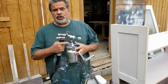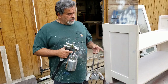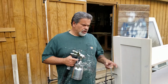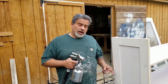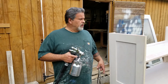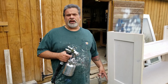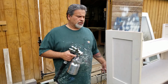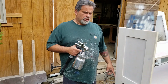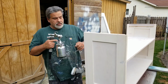And I'm spraying Enduro Clear, because I got a whole gallon of it. And I like it because it dries fast. And when I use it on this whitewash, I usually get away with one coat. I spray it on one coat, and then I let it dry, sand it down, and I'll give it a coat of flat out flat, or a coat of flat, whatever the customer wants. This is going to my booth, so I might just leave it satin. Who knows? So here goes, mask.